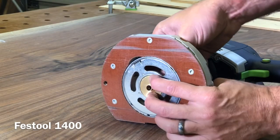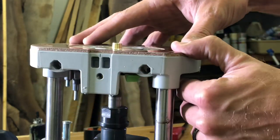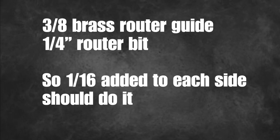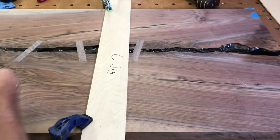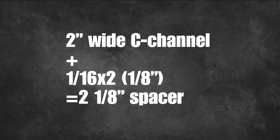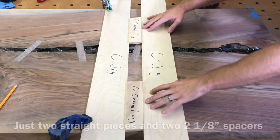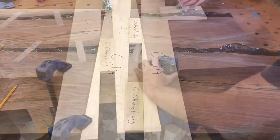I'm going to do you a favor and save you a bunch of time — and I wish I would have saved myself — by showing you how to make the perfect inlay for these. I'm using a quarter inch spiral bit and a three-eighth inch brass router bushing, so all I had to do is add an eighth of an inch to the overall width of my C-channel, which was two inches. So two and an eighth inch spacer, two straight pieces of plywood, snugged them up, clamped them down, and then removed those two and an eighth inch spacers.